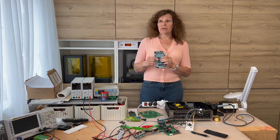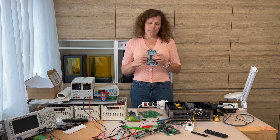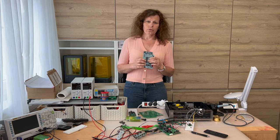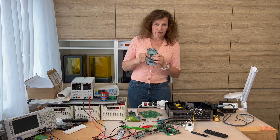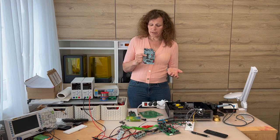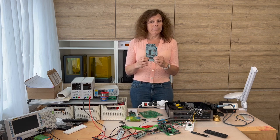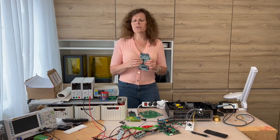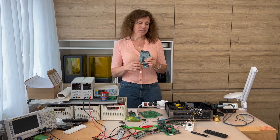So I replaced it, and although it was working quite well, it has some drawbacks. The communication between the microcontrollers is not synchronized, because the replacement CPU is using a cycle time of 16 MHz divided by 4, so 4 MHz for the CD player. Sometimes the CPU is not able to detect the information when a CD ends or a track ends.